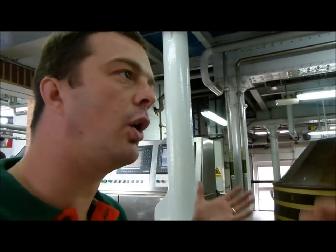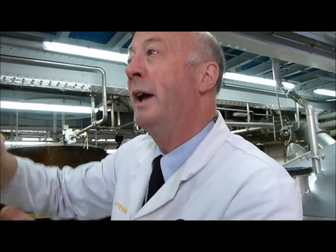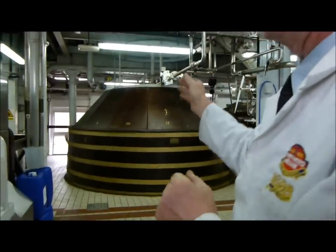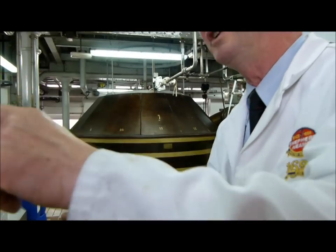Does the computer make things easier? It gives you more control over temperatures and time. This vessel here is steam jacketed — so we can mash in at a certain temperature, turn the steam on, raise it a little bit, and we can do what they call stepped mash conversion. You can't do that with the oak tuns because it's one temperature — when it's in there, there's nothing you can do about it. That's why what we did this morning was absolutely vital: getting the temperature of the liquor right, getting the consistency right. Let's go through and look at the mills.